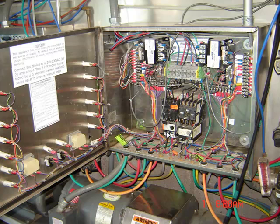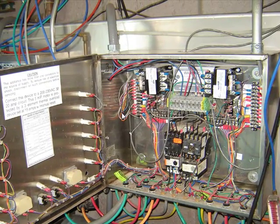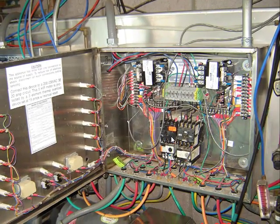When you hit the selector dial on your car wash, all these controls handle your rinse, your wash, your brush, your degreaser, your final rinse, and so on. This is where all the controls come back in, and it goes into a bunch of solenoid valves that allow the different types of fluids and detergents to go out. The call I got was that the pump in the whole bay itself just wasn't working.